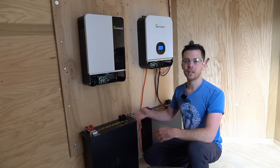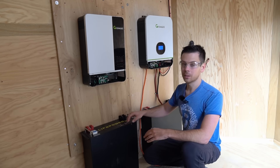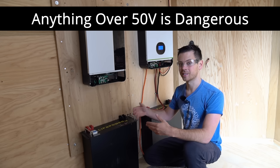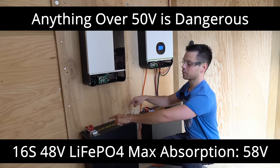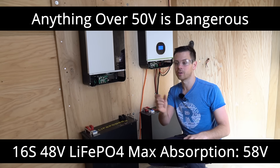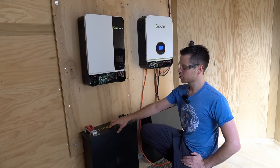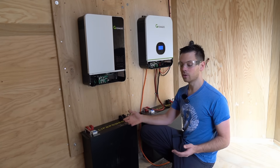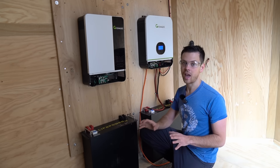The only downside of 48 volts is that when the battery is fully charged it's above 50 volts, and that can actually kill you. It can overcome the resistance of your skin and allow current to flow through your heart if you touch both battery terminals — one with each hand. If it flows through your heart and you have more than about 0.1 amps, you're going to die. So when these batteries are fully charged you need to be very careful.